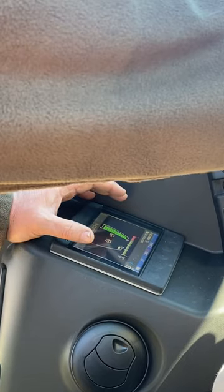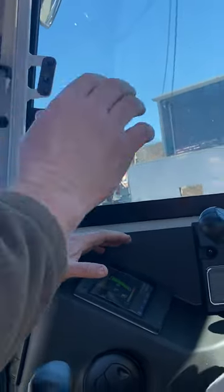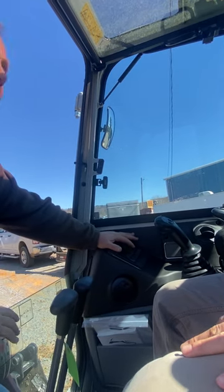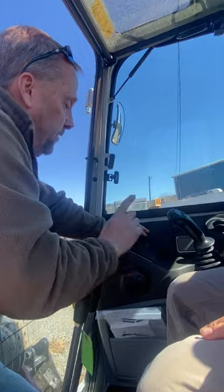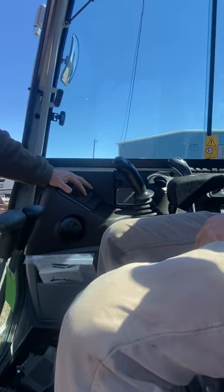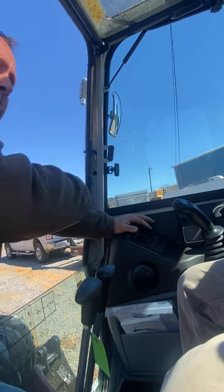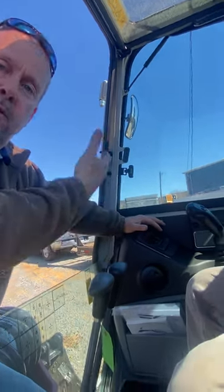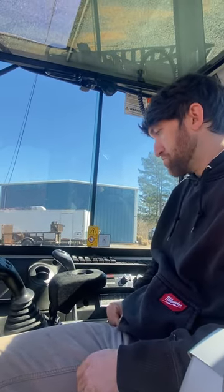I'm going to ask you to run it at full throttle. The red color on that gauge is not an alarm — it's just telling you that you're burning all the fuel you can burn at full throttle. I wish they had picked any color other than red. Similarly, every time the AC compressor is engaged, it comes up orange on screen saying 'AC.' All that means is the compressor is on; it'll cycle off and come back. But why orange? It should be blue — our switch even has a blue light in it.